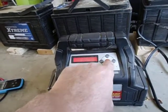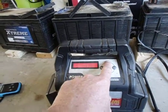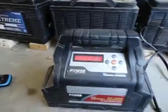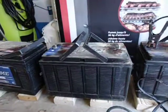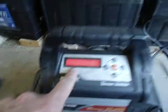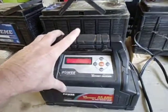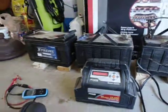We'll come off charge and check voltage again. Now it's showing 8.3 volts. This one shows 2.7. This one shows 3.1. They were all three pretty close, but now I'm starting to gain voltage. So the battery recondition with this charger appears to be working.